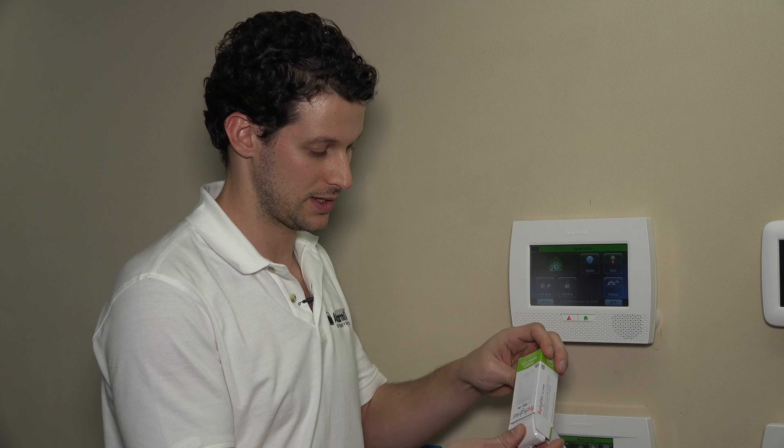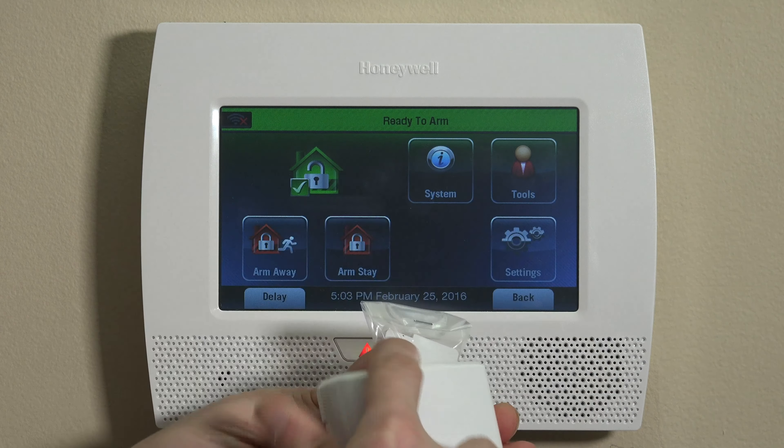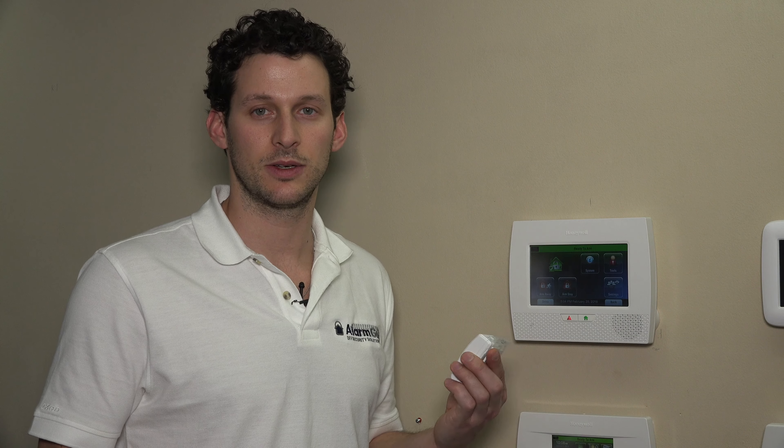So the first thing we're going to do is put in the battery. There's a back plate with some screws in it, and that back plate is what you can screw into your wall. There are two little keyholes that sit into the back of the module, so you could screw it up to the ceiling. Generally, you want to have this within three to six inches of just one of your smokes. It doesn't matter which one, especially if they're interconnected. If they are not interconnected — meaning if one goes off they all don't go off — then the only smoke detector this will monitor is that one within three to six inches. To test whether your smokes are interconnected, press the test button on one of them. If they all do not ring out, they are not interconnected. If they do ring out, then they are.